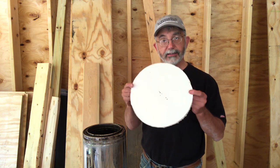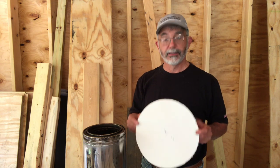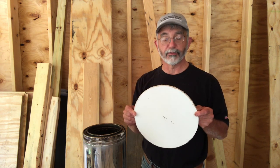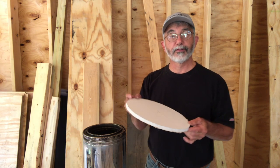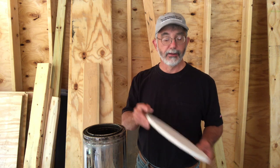Now, if the roof were flat, this 12 inch diameter circle would do it — and this actually came from the ceiling below where I'm going to cut the hole in the roof. But as the roof inclines, as the pitch of the roof changes, the shape of the hole changes. It needs to become more elongated. It becomes an ellipse. That ellipse size depends on your diameter that you want and it depends on the pitch of the roof.